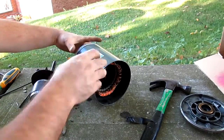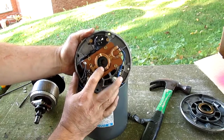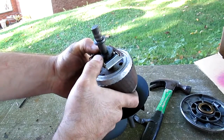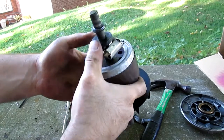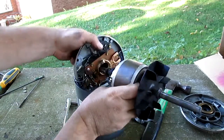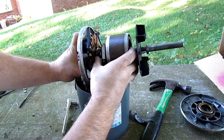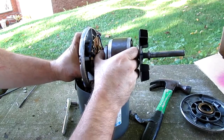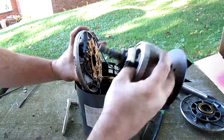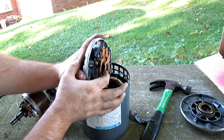Don't do that with delicate parts or parts you plan to keep. I proceeded to take the back off this motor. What you're looking at is the actual switch — this is a centrifugal mechanism right here. When it's in a ready-to-stop state, this is pushing back on your switch, so your start windings are energized. Now when this ramps up to speed, that draws in, this finger slides up and hits the run contact. When it was running, it was just sitting in there chattering like this.